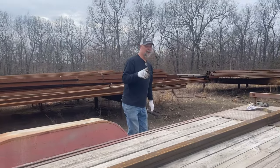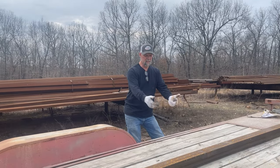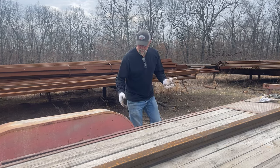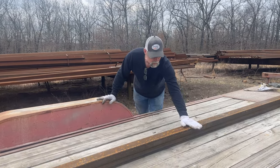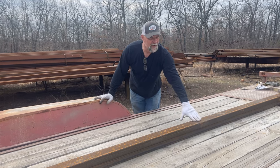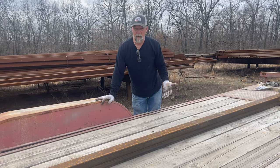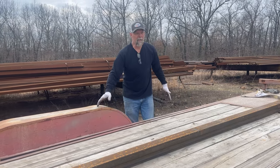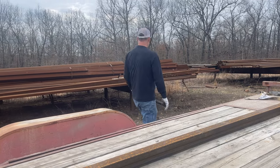I need some uprights for the pieces of tube on the bottom up to the cook chamber. Dimensionally, this is two inch by four inch, and I want the four inch side flat. Aaron and I like to actually go half of this — it just looks good that way. So we're going to do two by two on here. I don't need a lot — I probably need like a 20-foot stick and that's it. Time to go shopping again.